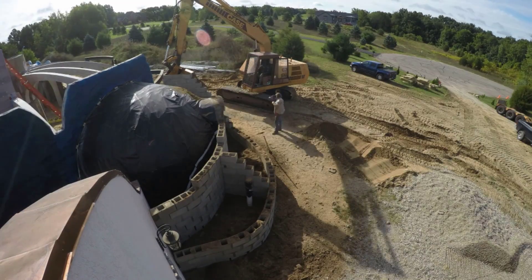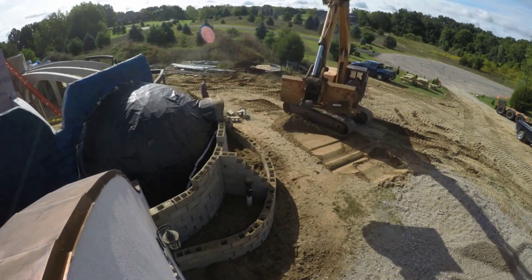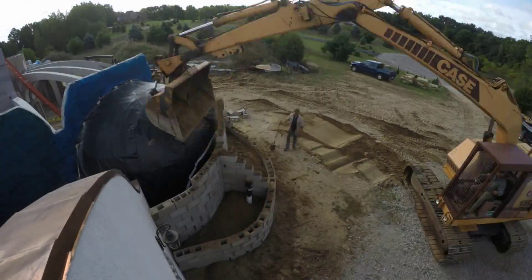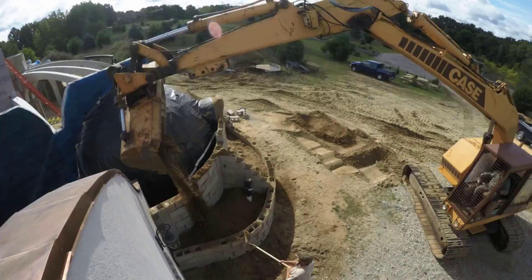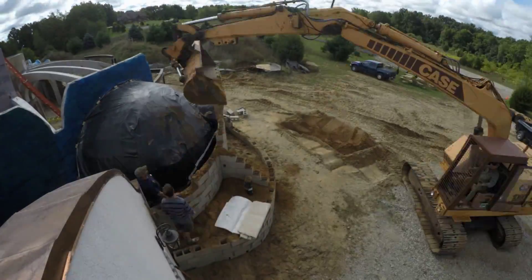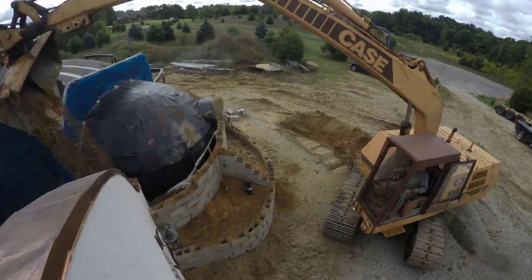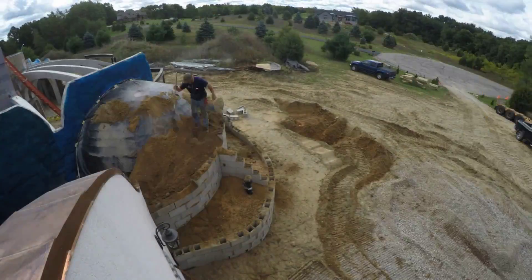The Roe brothers were nice about it though, and they talked about ways to save the wall section, but I knew it was hopeless and just told them to let it fall and move on with the rest of it. If the retaining wall was going to fail somewhere else, then today was a good day for it. There we are putting in some horizontal carpet layers, intended to reduce lateral loads. I wanted to put more, but things were moving fast and costing hundreds per hour, so a few layers here and there is all we got.